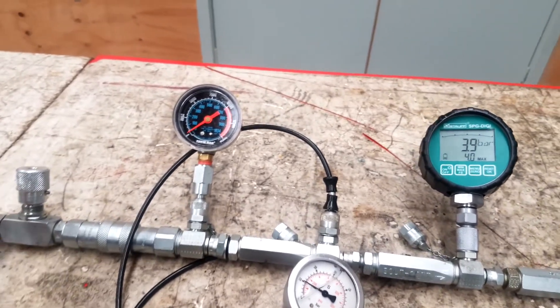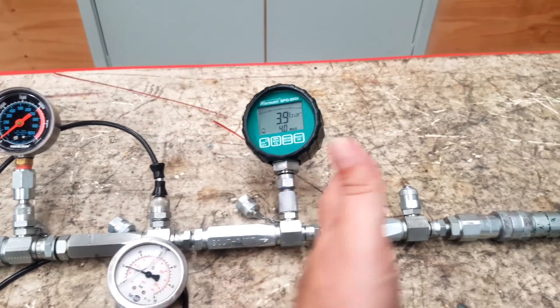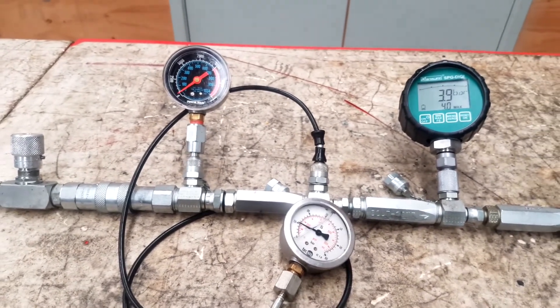At the moment I've got oil coming through here through the flow control valve, through my first check valve or resistance, my second check valve and my third. This is what we consider as a series circuit and this is how we measure the pressure in that series circuit.